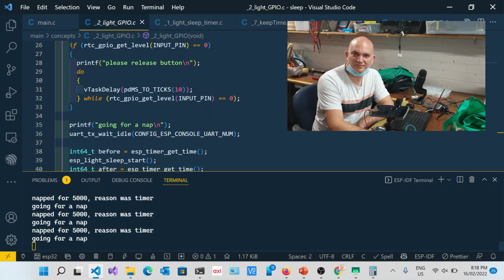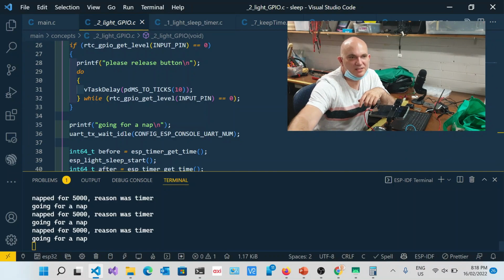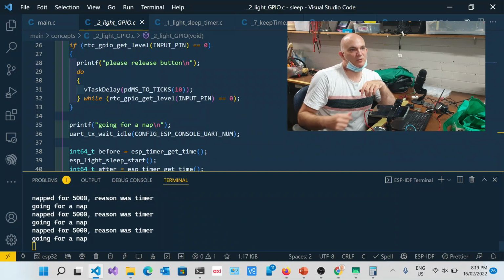Probably less critical though, because you're not worried about a double, because you're just going to execute a fixed script typically. That's right. And so it's not going to double execute or something. It's only when you're trying to differentiate between the buttons, long press and things like that. It's the same thing where, let's say for example, this tilt switch on your post box, right? Once you actually execute the wake up call, if that thing is bouncing, who cares? Exactly. Just ignore it.